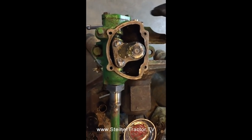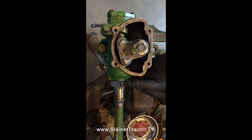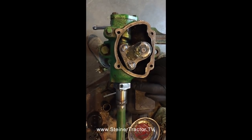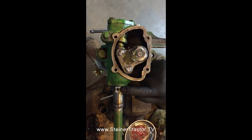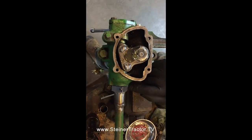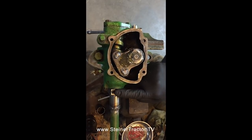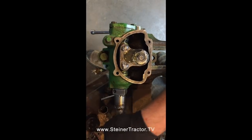Alright, so we've assembled our gearbox. We had a couple of issues. We had to chase the threads inside this coupler, which is a 1/4-28. It's a fine thread. We also had to source this bolt, or cap screw. It's an Allen head screw, 1 1/8 long, and 28 threads per inch. So if you have to source it at a hardware house, or you can actually still purchase it from Deere if you need to buy it, they still source it. That's where ours came from.